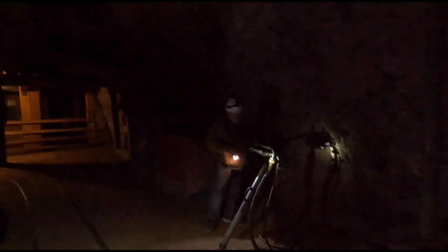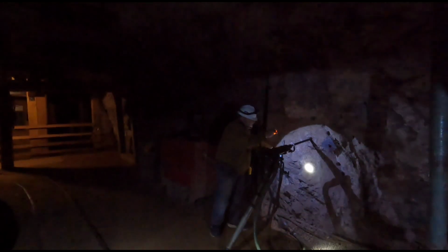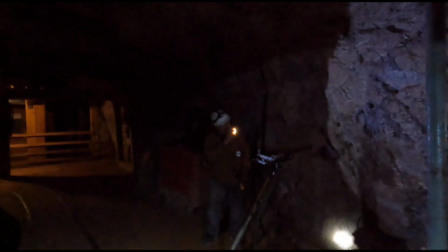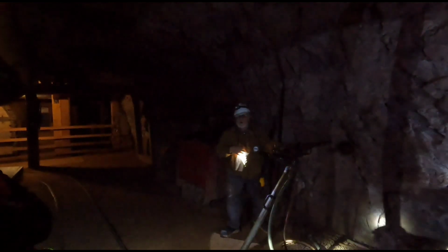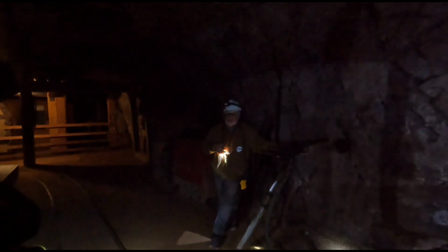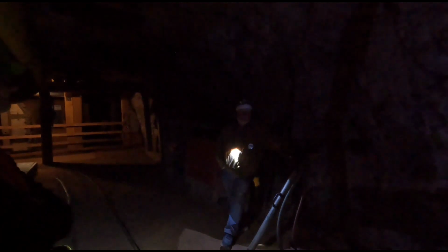But what happened here is they would pump the water down through this drill, has a piston in it, like I said. The water would gush out through the end of that steel, and they had those carbide bits on it made by the Timken Steel Company. So as you're drilling that hole, that water would saturate that dust. It was no longer airborne, could no longer float. It was not microscopic little floaties in the air. It was now mud, and once it was mud, nobody breathed it.